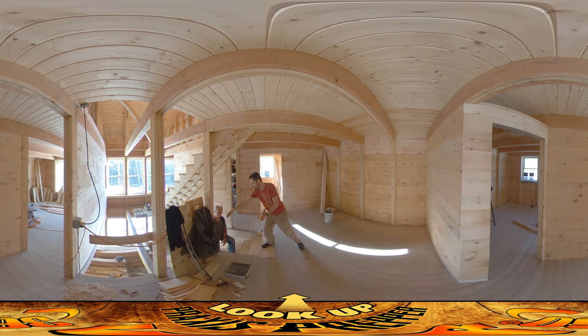When that railing wraps around it gets weird, and that's what we're trying to figure out right now — how we do that here. We can't have the balusters on the outside surface here because then it starts squeezing in on the stairway width, which is both a code problem and it would just look stupid too.